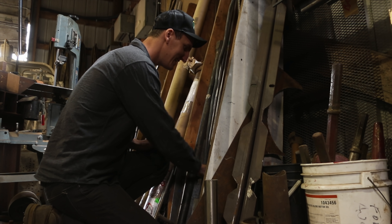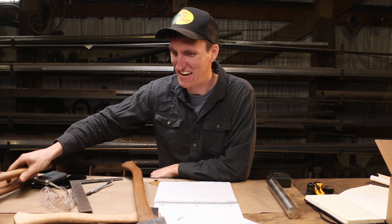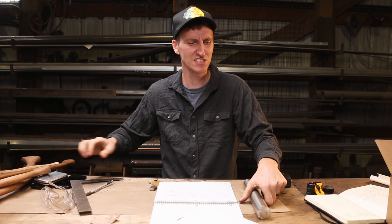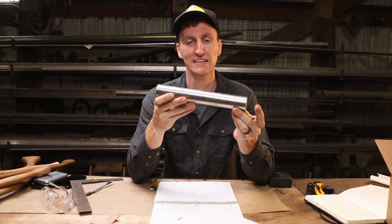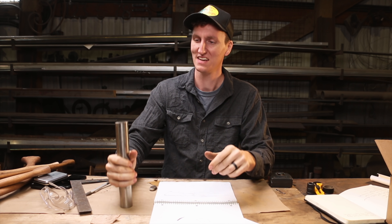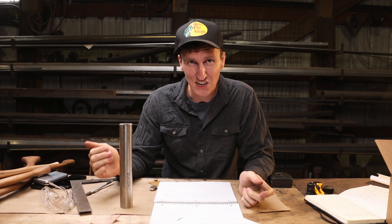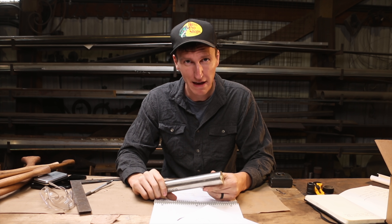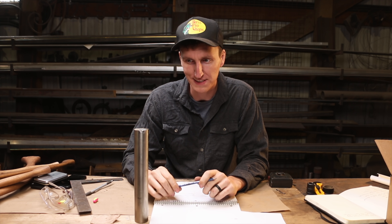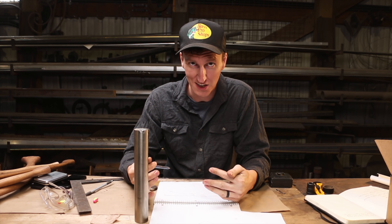Here is the Inconel. Inconel alloy type 718 — the only type of Inconel I've ever seen or had. If you don't know much about Inconel, welcome to the club — neither do I apparently. It was developed just after World War 2 for increasing the life in turbine engines and planes. It is considered a super alloy; it holds up in extreme pressure and temperature. The big deal with this stuff is that it work hardens, which makes it tough for machining.